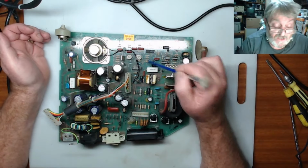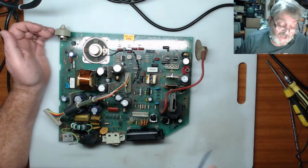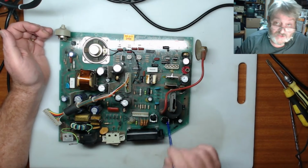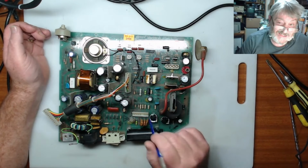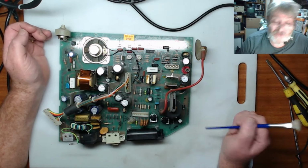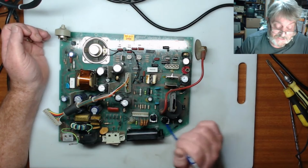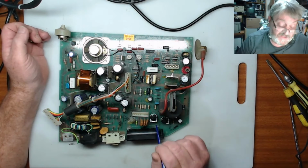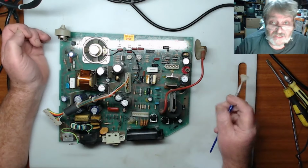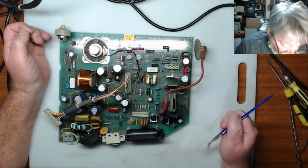and that this is just some oxidization on the board that we can clean off and they will still be okay. I'm a bit worried about the variable resistors, these two pots up here, and that it's gone underneath them onto the tracks. If it has, then it's a matter of finding out what these exactly are and getting a couple of replacements for them. Hopefully not. But yeah, we'll go through and clean this up and try and get as much of this off as possible.